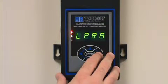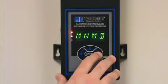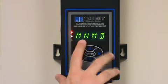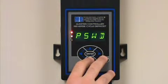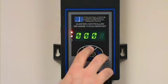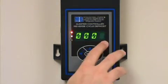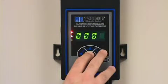To clear these alarms, you can scroll right and left to the manual mode column, which is represented by MNMD. Scroll into this column. If you've not entered the password at this point, it will prompt you for a password. Enter the password for your controller and press and hold the enter button down once you've entered that password.